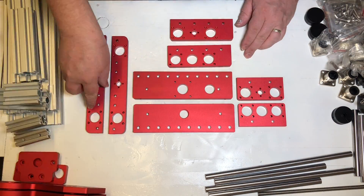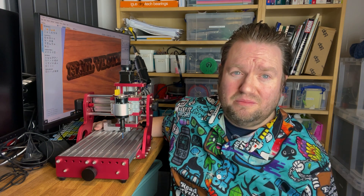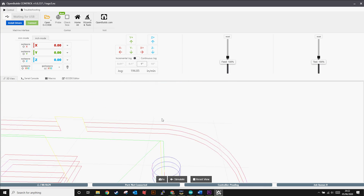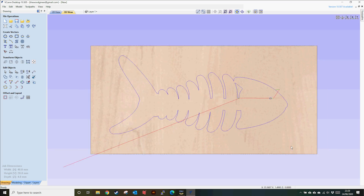Clearly, I love this little machine, though I've only just begun to explore the possibilities of what I can make with it. Yes, it's in kit form so it does take a bit of time to build and the software isn't great, but it's cheap for a CNC of this quality — a nice introduction to CNCs without paying through the nose. The rubbish software is easy to solve by using OpenBuilds or Universal G-Code Sender, and I've been using Vectric Aspire to create my designs, which is absolutely fantastic. I've given the machine 4 out of 5 teddy bears and highly recommend it as a small desktop CNC for beginners.